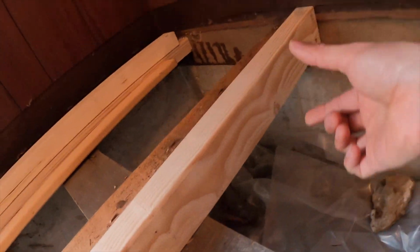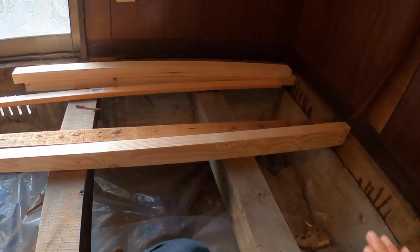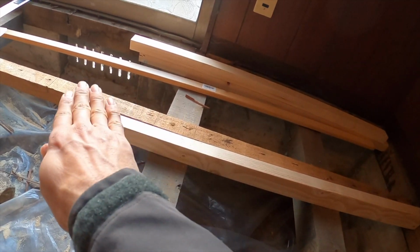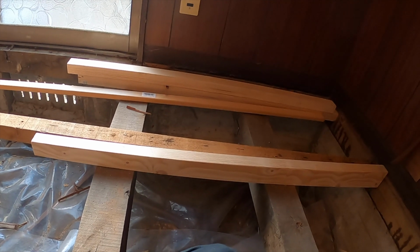The floorboards will get installed over the new joists. The new floor joist will begin where the old floor joist dips, so it will correct the problem where it starts. This should fix and correct the problem and level the floor. Look, I'm not saying it's going to be perfect, but it should be much better than it is now.